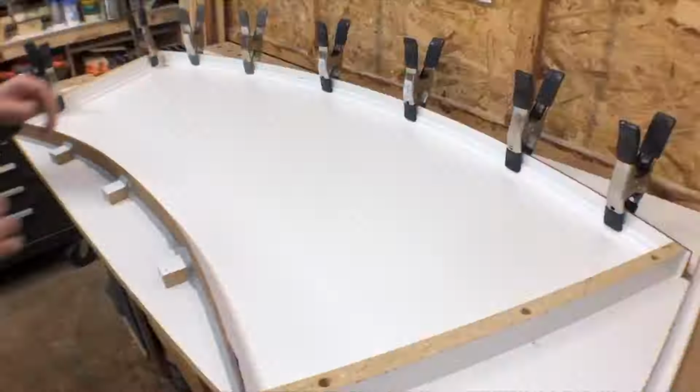An undermount sink would cost anywhere from $200 to $300, and it'd probably be special order, and it won't come with a faucet. This one is $100 and it comes with a faucet. Don't be intimidated. This is gonna be very easy, and I'm gonna show you. Mark the depth at 1 inch with blue painter's tape, and don't drill past the tape.